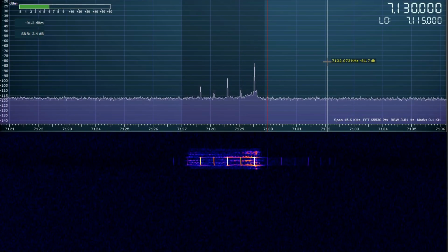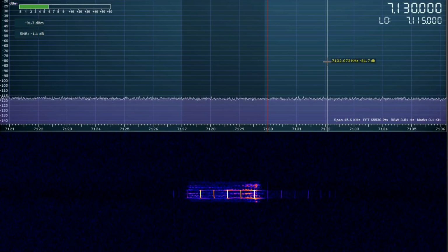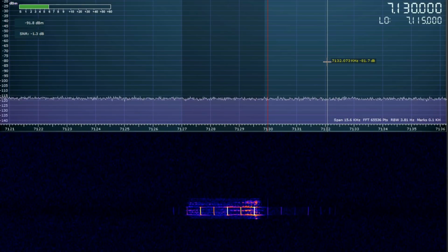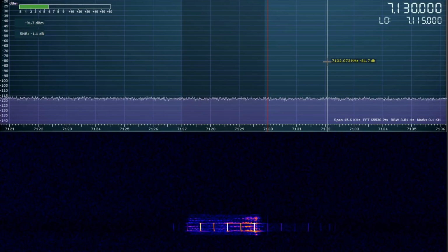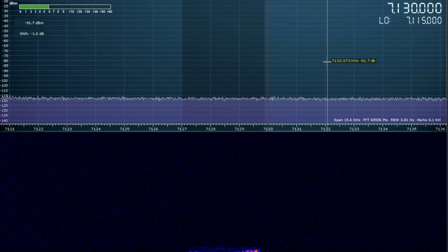But the compressor function is something else altogether, and I'm going to put a video together for everyone and basically show you how to get your radio set up right. It is very easy to overdrive your radio with these compressors. Is that a big deal? Well, if you're in the noise and you turn it on and someone can hear you and they can't hear your overdriven IMD because of their noise floor, it's probably not a big deal. But you can actually set them up so that you're not generating any more IMD at any significant levels, and you're still getting the full benefit of the compressor. So I'll demonstrate that in the next video, and I hope you enjoyed the sneak peek.